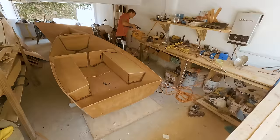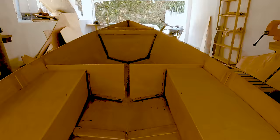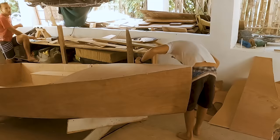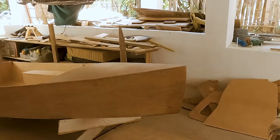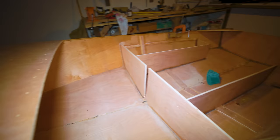I wanted to create a forward deck on my boat in order to have a storage compartment and minimize the water coming into the boat. So I added a light curve on top of the forward peak bulkhead in order to add camber to my future deck. I then placed a piece of 4mm plywood on top of the bow section and traced the shape of the bow onto the plywood, giving me the exact shape of my deck panel. I made a second identical panel and applied Gorilla Glue between the two, then screwed them into place. Once the glue was dry, I had a stiff forward deck panel with the curve I was looking for.